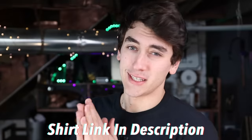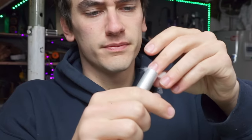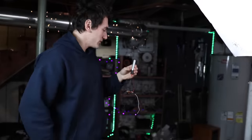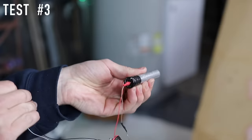So when you get hit by this you don't just have to worry about the darts digging in — you get a little electric shock sprinkled on top. Once again, don't try this — it's just a cool engineering challenge to see if we can bring something from a fictional movie into reality. To fire this thing we're using flash cotton — nitrocellulose, super flammable cotton — which acts as the propellant. We're making a mini cannon with an arc lighter as the ignition source. Shove a little flash cotton down the barrel, press a button, and boom — firing in three, two, one... Jesus, I think that's gonna work!